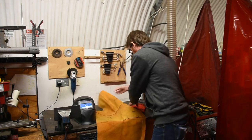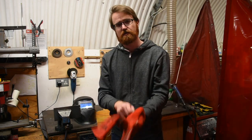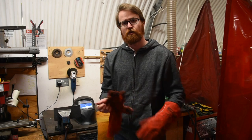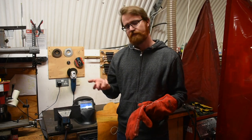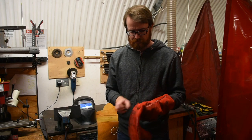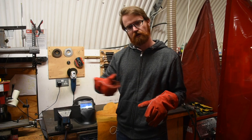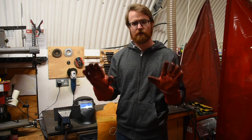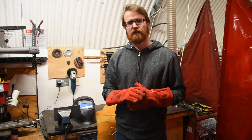It's important while you're welding to wear welding gauntlets. It's recommended you wear them for both hands. Some people find that when manipulating the MIG torch with a gloved hand it can be harder, so it's not strictly required that your leading hand holding the torch be gloved, but I definitely recommend using both gloves as a beginner to operate safely.